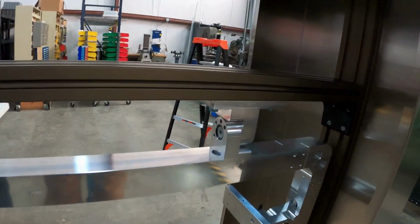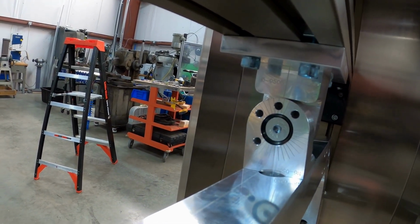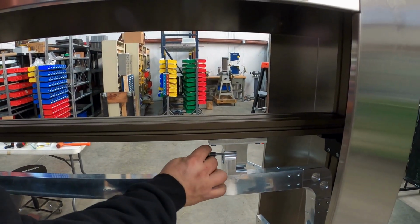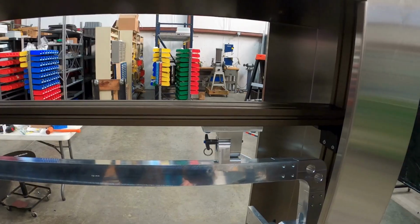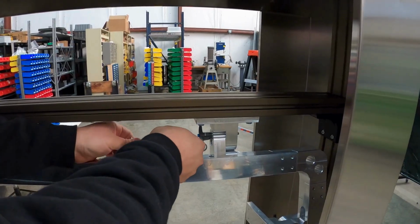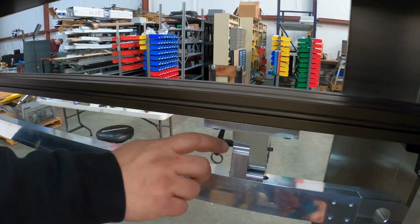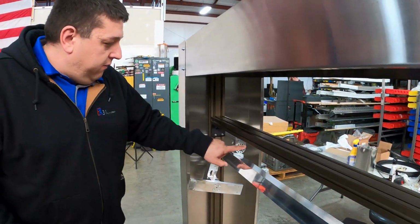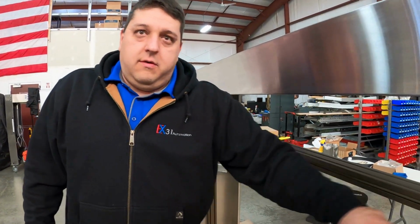If you look down your hole set here, the first hole you're going to come to is a 7.5 degree increment in position. I don't remember exactly which one it is, but we can try that one. That's probably 15 degrees. So 2 times 7.5 would be 15, and that would be a 15-degree offset. So it's not only always flexible, but you can also do it in 7.5 degree increments on the pin position, which is why it has that shape in the face and the back for all the locations, plus the offset locations on the front of the face.